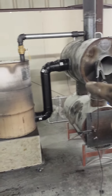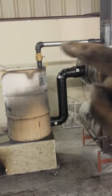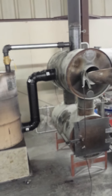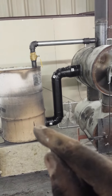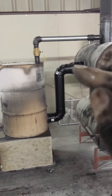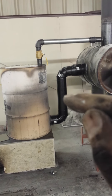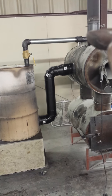What I've done here is I got a two-inch line with a ball valve going into just below my damper for the other heater. I also have the regular exhaust — now this is a five inch. Remember: six inch through, eight inch up, five inch out. This right here is going to have a damper in it, which I have not put in yet. I just welded up that little coupler right there, and that nipple up there.